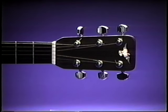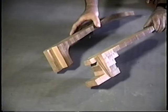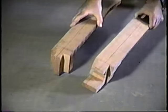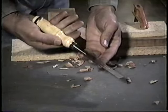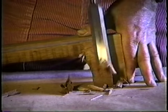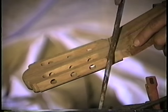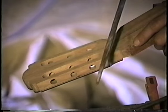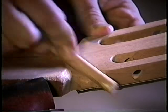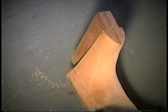The head of the steel string was much easier to make — only holes for the tuning machines were needed. We then roughed both necks into shape using long-handled chisels to work on the heel, saving knuckles from hitting the wood. A one-inch chisel was most useful along with a rasp; some builders also use gouges and power shapers. The object is to get fairly close to the finished dimension, saving the final shaping for later.